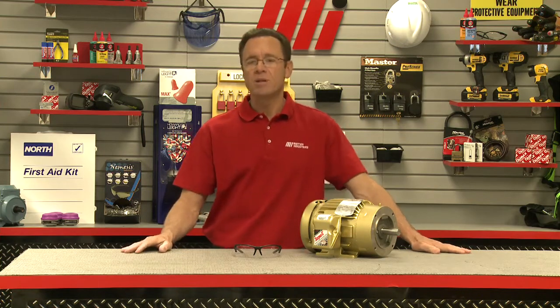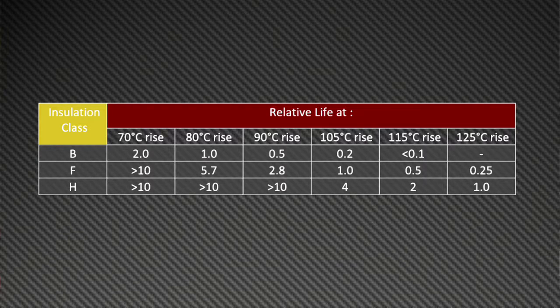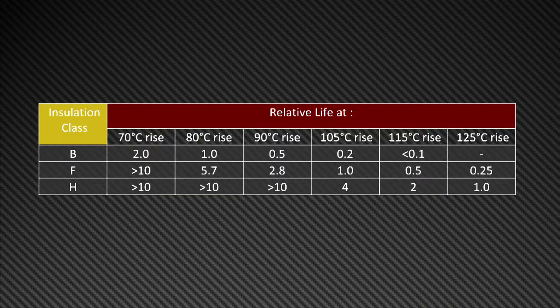So why do we have a service factor at all? It's because of the trade-offs provided by the relationships among a motor's thermal design, loading, and service life. Look at the reference table here on this video — it shows us that the thermal aging of the insulation system from normal operation or due to overload will eventually cause the failure of even a properly supplied and properly maintained motor. The hotter a motor runs, the sooner it's going to fail; the cooler a motor runs, the longer it may be expected to last. Hot: fail. Cool: last.